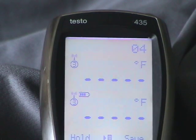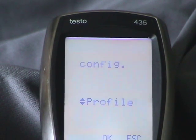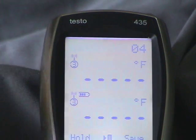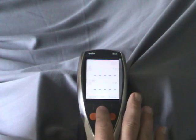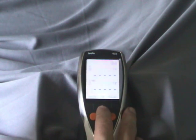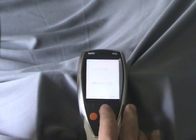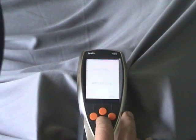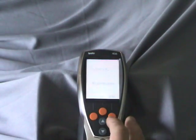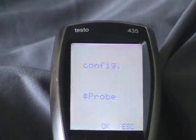The first thing we do is go into the deep menu. We hold the center button down until profile shows up — that's the middle soft key, the middle orange key. Press it once and you get normal mode. Press it twice and you get into what's called the deep menu. There you have profile, language, probe, device, and units. This is where you do the base programming for what you're doing. We're going to run down into the probe menu.